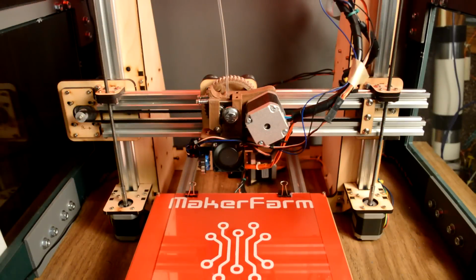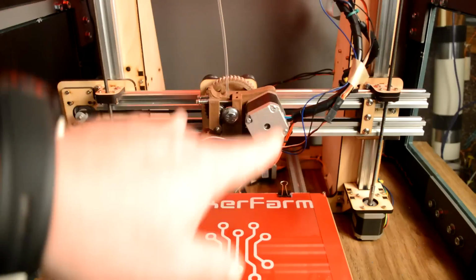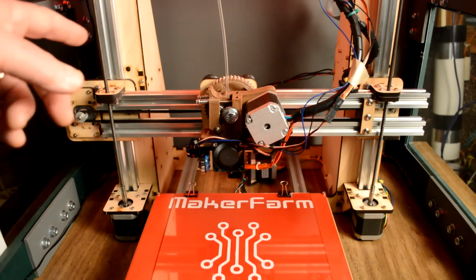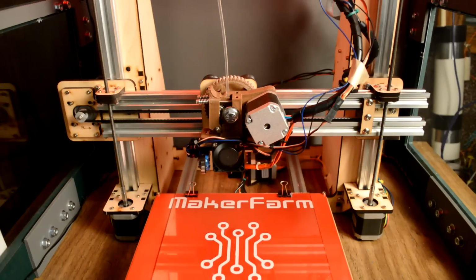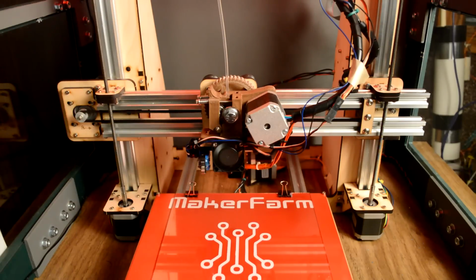Another reason I think it's worth noting why the Z-axis changes position is because there's two stepper motors, and they're paired together to lift the carriage up and down. And if one of the motors stalls out or hits the home position and the other is still moving, or you just don't have this set up exactly level, then it's going to be out of square basically. So anyway, bed leveling will take care of all these problems. So let's get started on that.